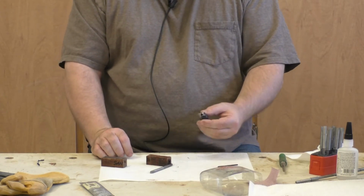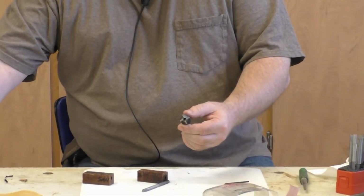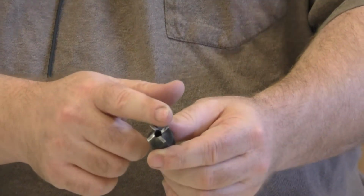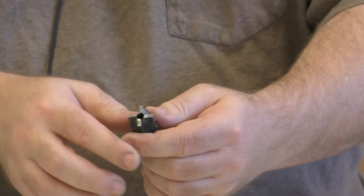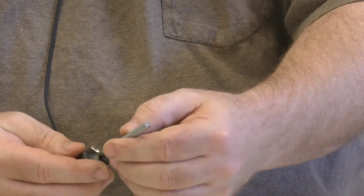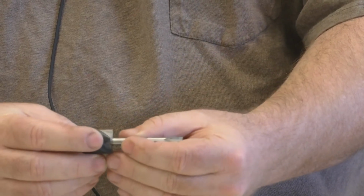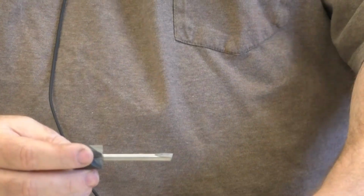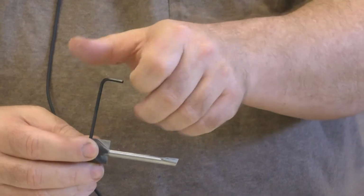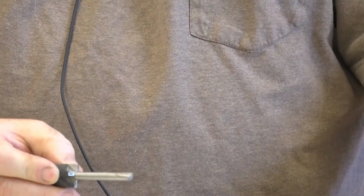Many pen mills are really kits. They come with a basic set of trimmer that has carbide or some sort of high-speed steel cutting bits. And you insert various size bits that are designed really to fit the type of pen blank that you're making. In this case, I'm using 7mm. So I put the proper insert in. Use a little Allen wrench here to tie it down. Alrighty.